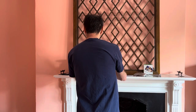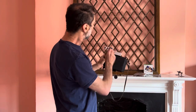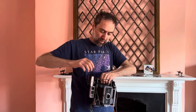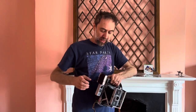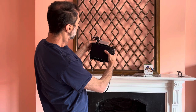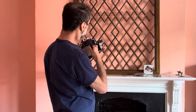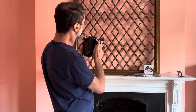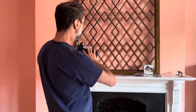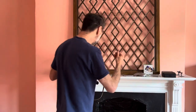And that's it. This camera — let me go in reverse. So to disconnect the flash: flash off. Make sure when you unplug it, pull it straight out and kind of wiggle it out. When the flash is disconnected, I close the socket in place. Let's put it back in and make sure it goes all the way in. Turn it off. Let's remove the Lomography back — it comes out with some force, as it should.